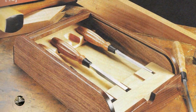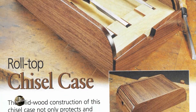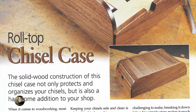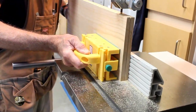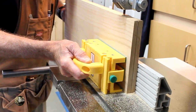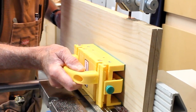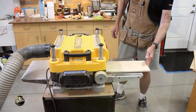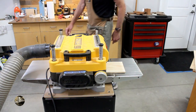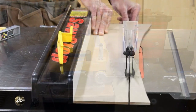The inspiration for this build came from the August-September 2018 edition of Woodsmith — it's their shop project, the Tambour Chisel Case. I started with 4/4 ash and re-sawed it for the sides and the ends. The box members are 3/8 of an inch thick. I took these pieces over the thickness planer to clean up both faces and get them down to 3/8 of an inch thick.